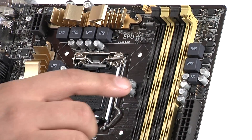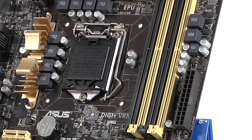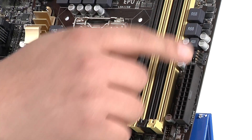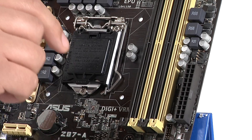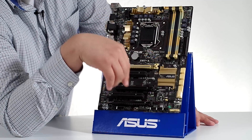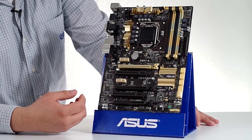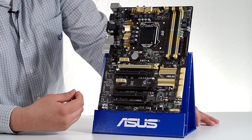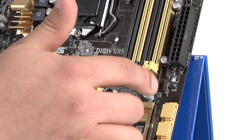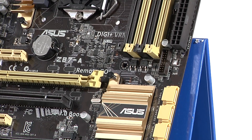We've got some inductors or chokes to help provide power and stability for overclocking on the DRAM side. This board has already been validated up to 2800 speeds, so you can feel very confident that even from an overclocking perspective the Dash A is going to take care of you. Moving down we see a couple of capacitors, another four-pin chassis fan header, and then our 24-pin power for the PSU and motherboard. Even though this is a value-oriented SKU, all capacitors are still our FP5K rated — that's twice the industry average compared to competitors using 2K or 2000-hour rated capacitors. We've also got a front USB 3 header that works with our AI Suite 3 and USB 3 Boost technology for faster storage device performance in Windows 7 or Windows 8.